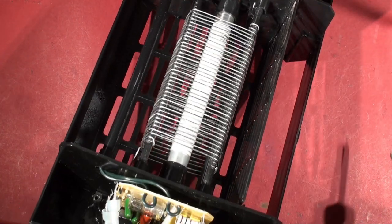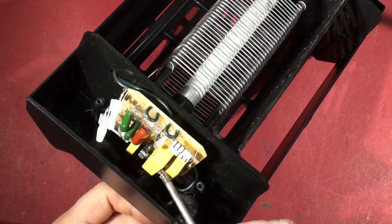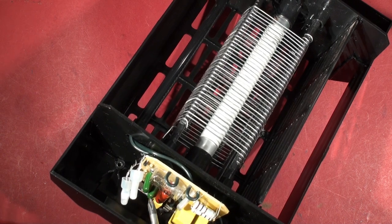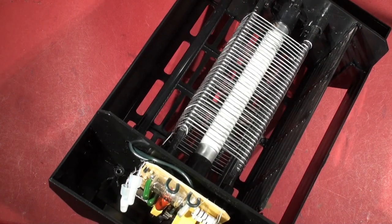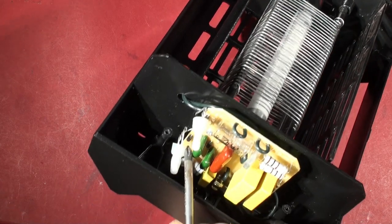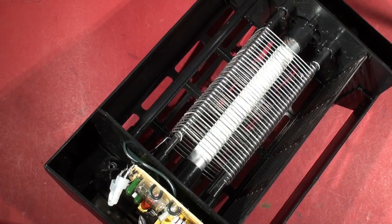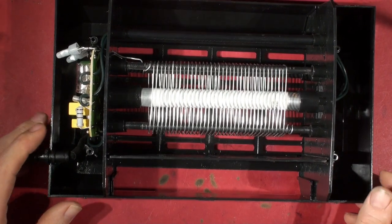What we have inside is a capacitive choke - dropping capacitors to provide current for the tube, a small suppression capacitor, a couple of 10-ohm resistors, and more capacitors crimped onto the aluminium wire. There's a voltage generator which is a doubler circuit - you can see it there. Then a standard four or five watt starter tube. I'll get this board out for a more detailed technical look, fire it up, and see what I can show.